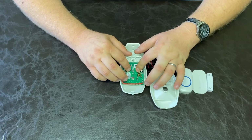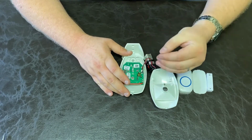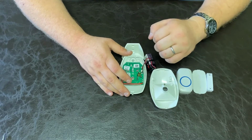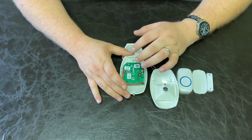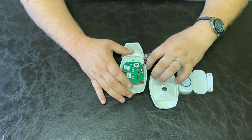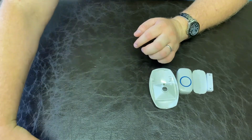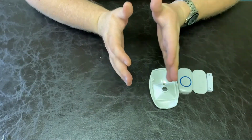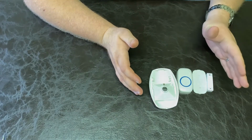There we go. Every time you press the increment button, just confirm with the LED that the press was acknowledged, as you saw now. Now this passive is on code 151. And the channel is zone 3. With our alarm panels, you'll notice in the manual that obviously all of your detectors must have the same wireless code and your remotes must have a separate wireless code.